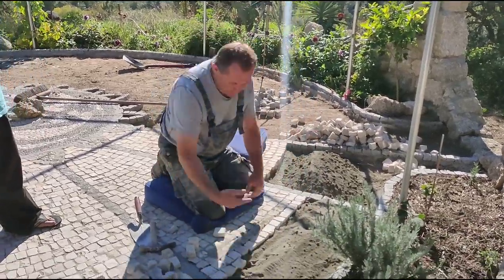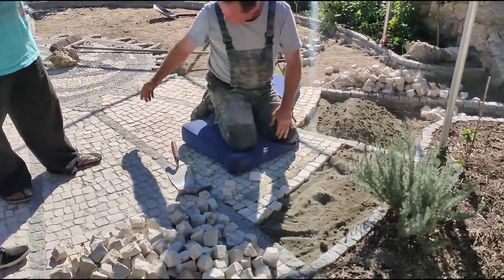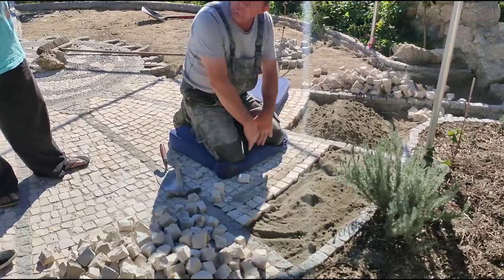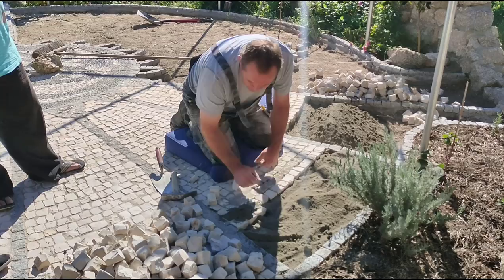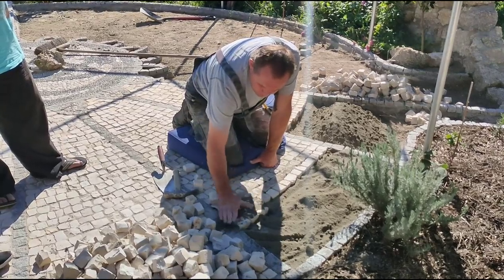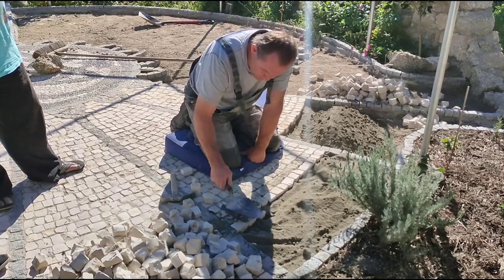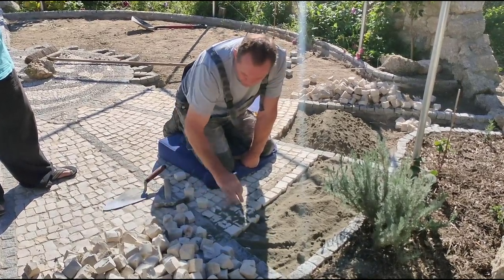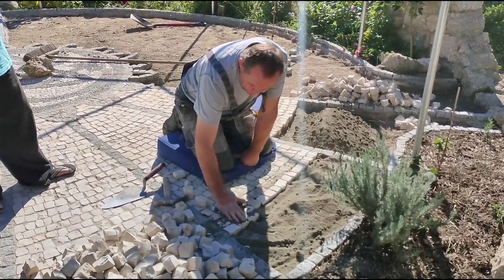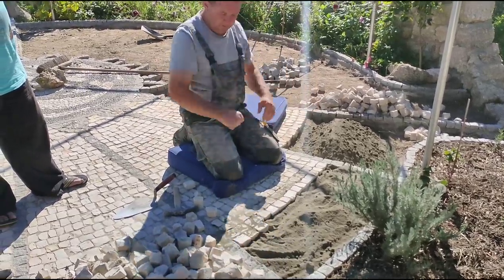And the way, once you've done, if you needed, you won't need to, but like, where I've come through here, every time you need to move the cushion on, yeah? Just put a bit of sand on it. Fill the holes with sand and just give them a little tap, and it works all the sand in the cracks, yeah? And then that's good enough to put a bit of weight on until you've filled it all in.